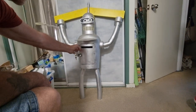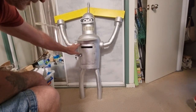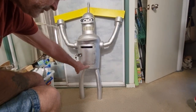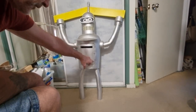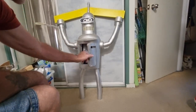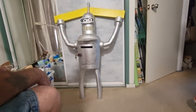Inside the door, I worked out where I wanted the door to be and I glued — I had to shape some pieces of wood to the curve, top and bottom and the sides. I glued them together and screwed them inside and out of where I wanted the cut to be, so once I put the cut through for the door it would maintain the shape. You can see some of the timber frame there. We've got some hinges on that side, a lock on this side, and that completes the door.